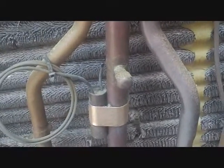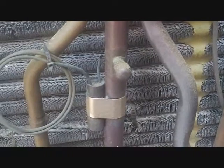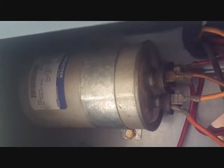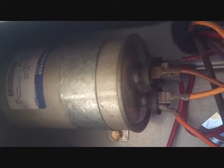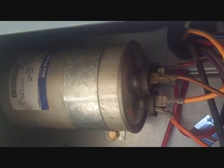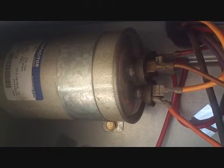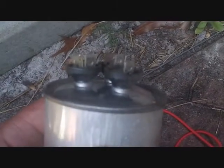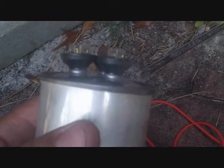It won't come on, but there's air coming out inside. First thing we go for here in the summer is the capacitor, so we'll go ahead and check that first. As you can see here, the capacitor is bulged out, indicating that it is blown. We'll see if it's just a blown capacitor or if we have a motor that blew this capacitor. We'll also check the start capacitor to see if it is good. You can see the top — how it's domed up. It should be flat.